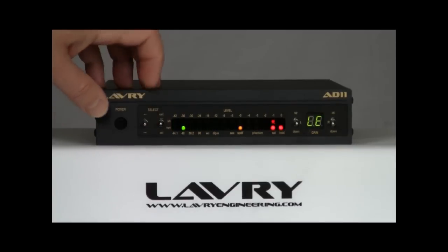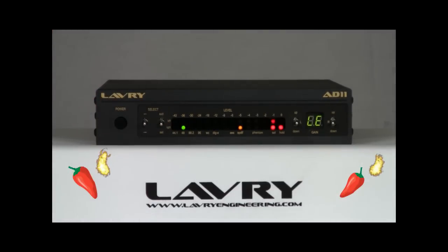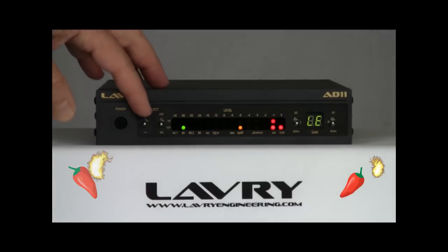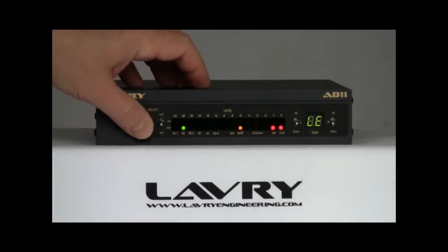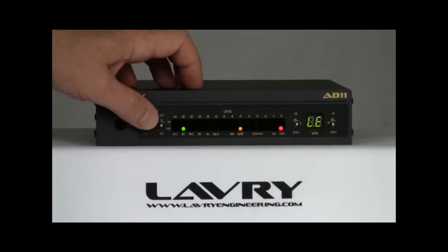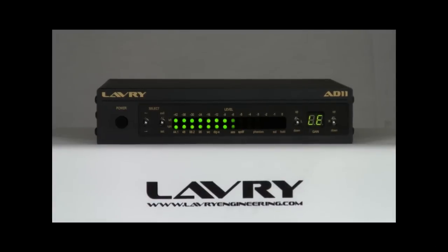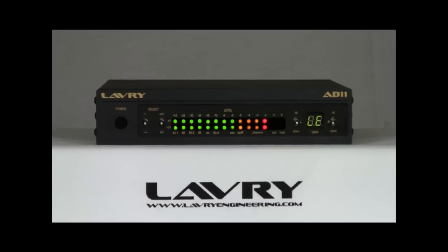The result of using the saturation mode can be a significantly louder track because, in addition to the 3 dB higher average level, the saturation can also allow for higher levels of digital compression or limiting without audible side effects by reducing the compressor limiter's overreaction to the highest peaks. It's a great unit, and we've received very enthusiastic feedback from AD11 customers.